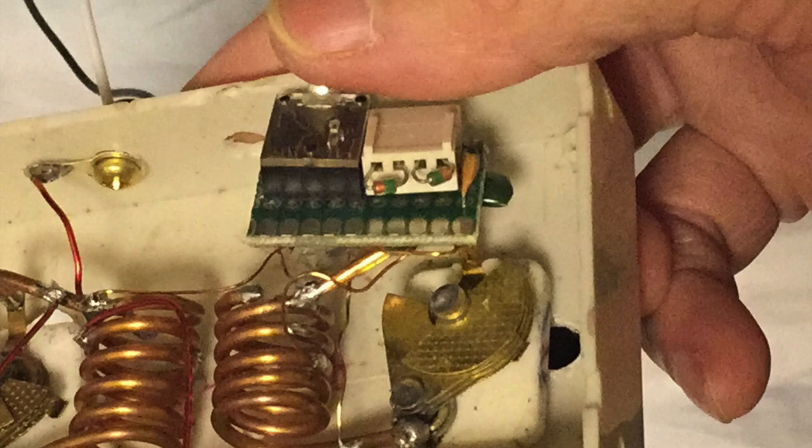I have tested this radio and the output is a bit low, much lower than the 3DQ version. However, we still hear very crystal clear FM stations, much clearer than just using slope detection. This one is even harder to tune than the 3DQ version. Because the output is so low, you have to hear that click sound when you hit the station and then keep tuning the other variable capacitor, back and forth tuning both capacitors until you hear the crystal clear sound.